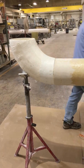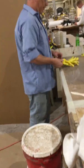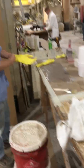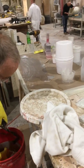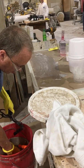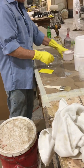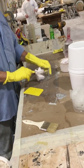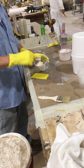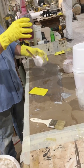As the hot glue cures it becomes stable. We'll go over to his laminating table — he's got his gloves on and the appropriate PPE, with cardboard on the floor. First task is going to be the talc. He has some talc being mixed with 922 resin — this is 922 with antimony in it.